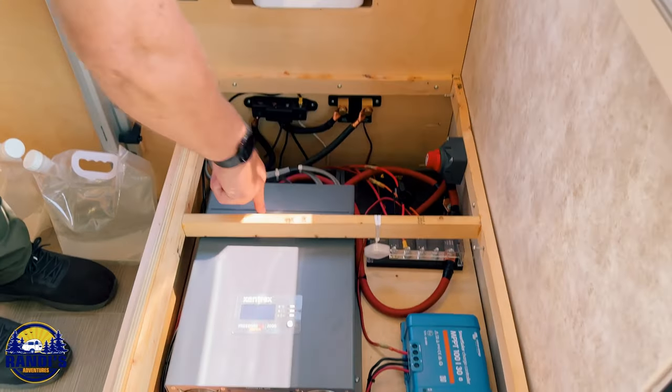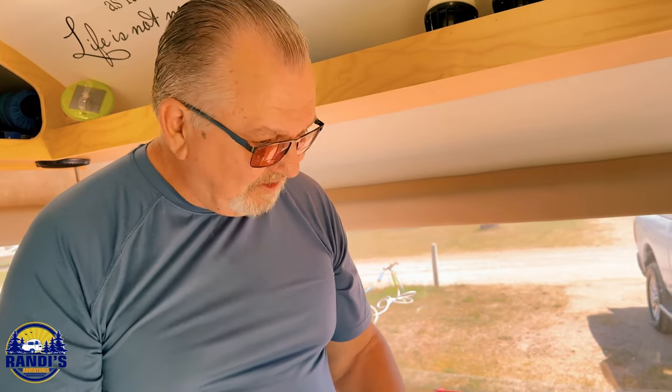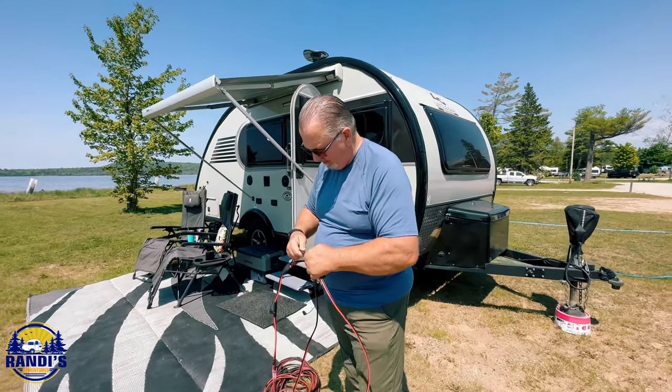You got two more here. And this is my battery shunt, which everybody should have if they have batteries — it tells you the state of charge of the battery. You never go by a voltmeter. You always get yourself a battery shunt, they call it. These are my solar cables — this is so I can hook them both into parallel.